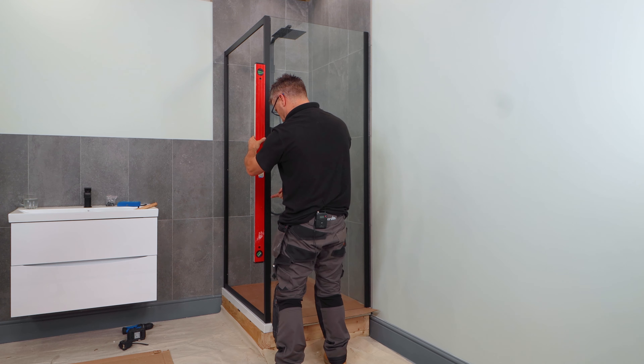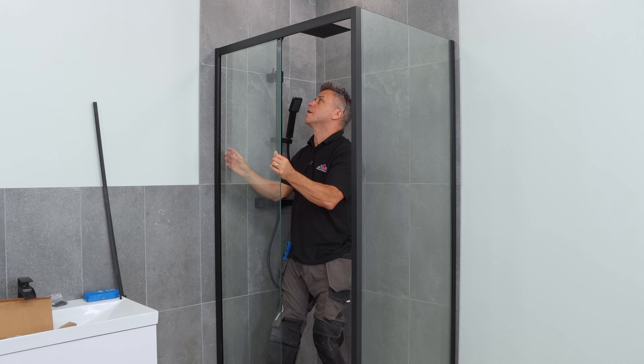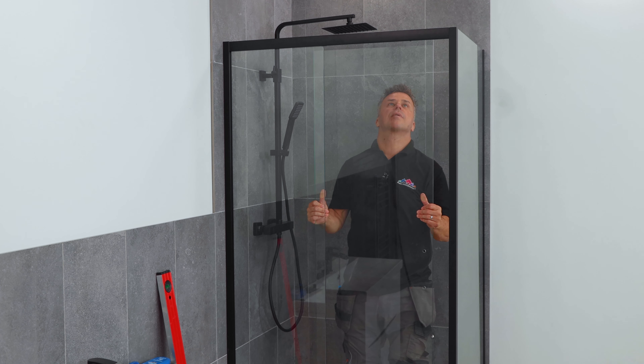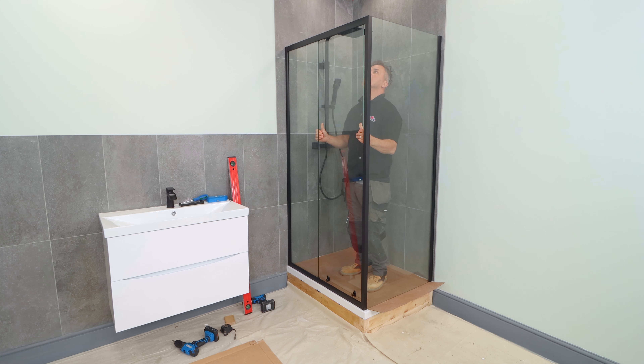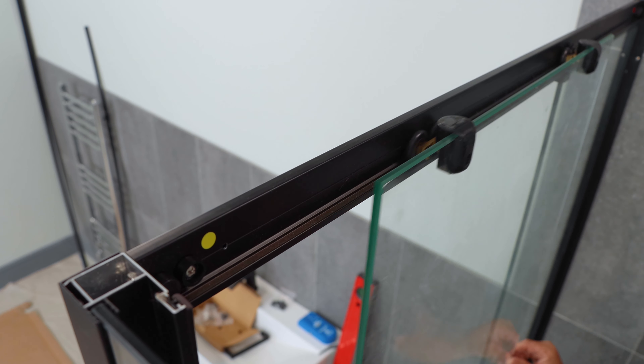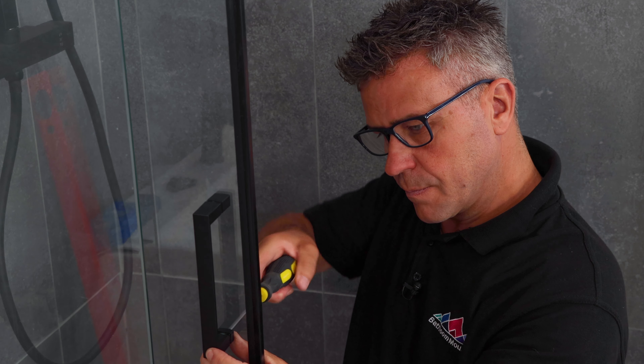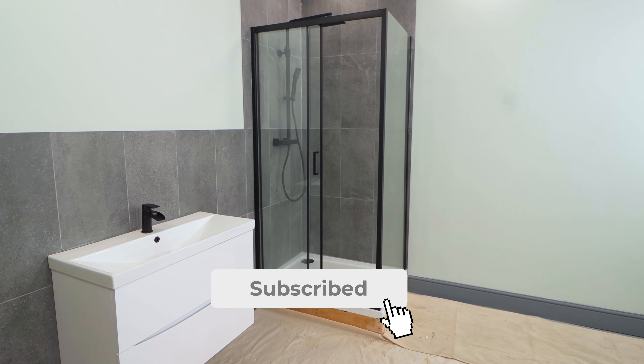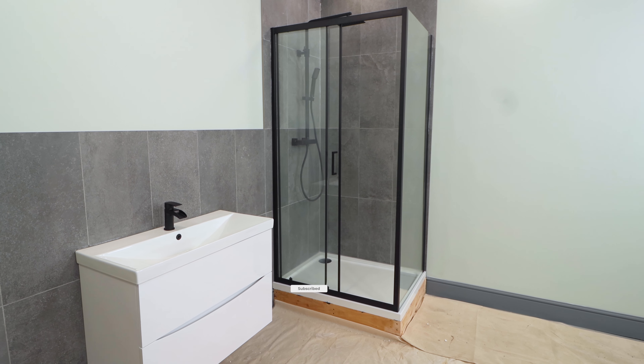The opening side has a side panel that needs to be put into position and then screwed top and bottom. Then you can hang the door — this is on casters and will slide from left to right. Once you're happy that it's moving okay you can apply the handle. Seal around the outside with a clear silicone. For more 60 second tips subscribe to the YouTube channel Mr and Mrs DIY.